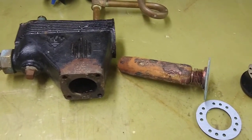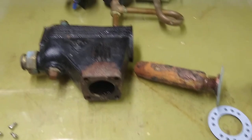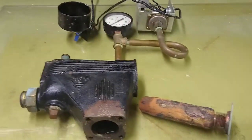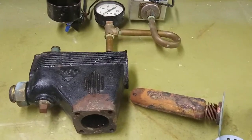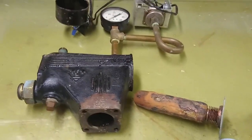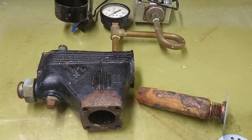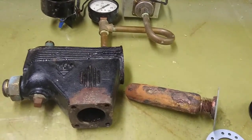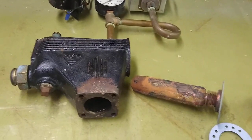I brought the switch down there and there was a guy standing at the counter that was quite the expert. I'm no expert in this kind of stuff, but I've been doing repairs on all kinds of things around my house for a long time. The guys at the counter are pretty knowledgeable, but this guy was even more knowledgeable. He looked at it and said you've got too much scale in there for that to move — you've got to clean it out some more. You're probably going to have to take the float out of there and clean it out.